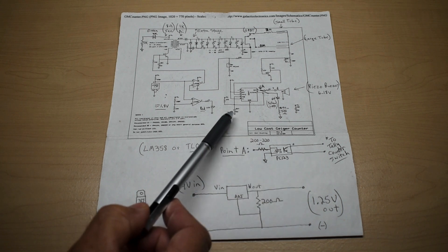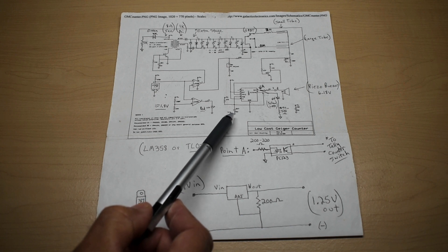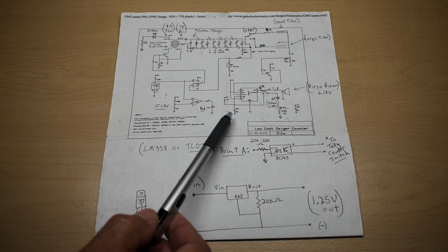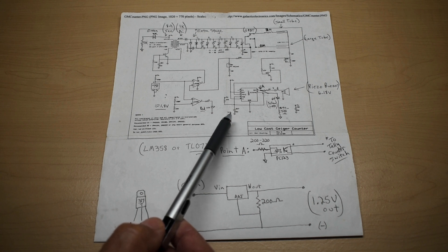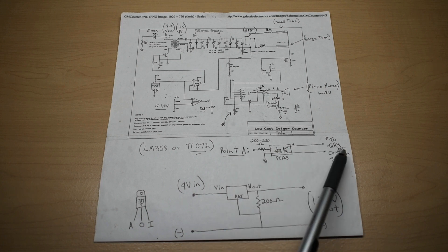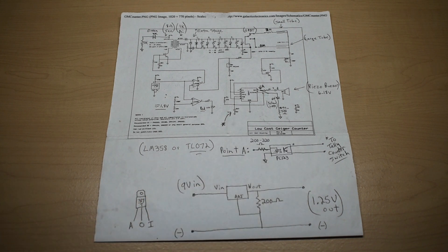The way to adjust it is with this capacitor — a 47nF, 25-volt capacitor. You would gradually increase that value: try a 104 capacitor, then 204, or even higher — 100nF, 200nF. I'm using almost 600nF because my tally counter was missing too many pulses. Now the pulses are wider and the tally counter is able to catch them. You don't want to make the pulses too wide, or you may miss some. And that's it — I hope you enjoyed this video. Be sure to rate, thumbs up, and share. Thanks for watching.